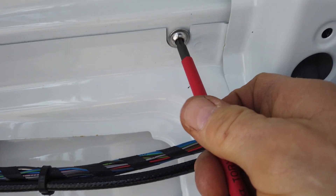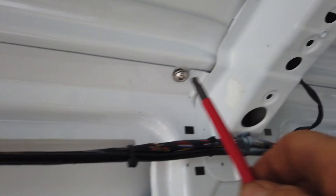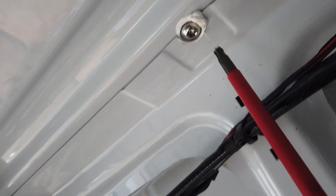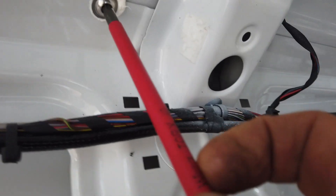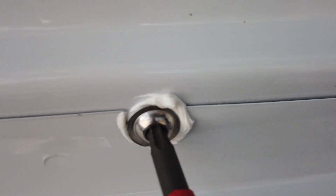So every nut is now secured with an allen key. I think the best thing to do is take each one out, put a lot of sealer around it — inside and outside. I may smooth that sealer over to make it look pretty but I don't think there's any need. That one slides into the recess in the panel. As you can see the sealer is pouring out.